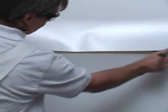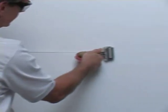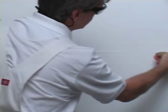If the wall has been cut, a layer of glue should be brushed into the wall to ensure a proper seal. The joint can now be formed. Clean off excess glue and roll the edges tightly into place.